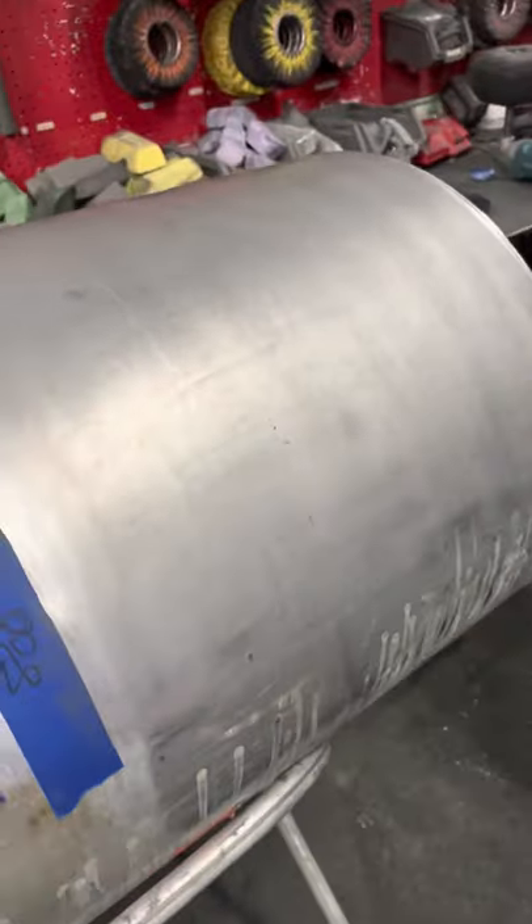I don't know how well you can see this, but the pores are starting to close over at 1,000 already. It was looking shiny over here at 800 and 600 grit, and now that we got to the 1,000 it's starting to close the pores up. This isn't with a rotary - we will also test that out. But you can see the pores are closing up pretty good, and that was 1,000 grit. We're now moving on to 1,200 grit.